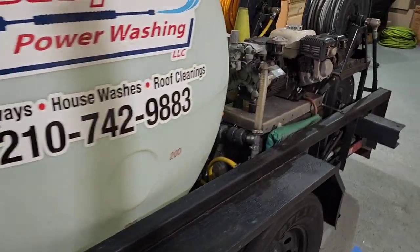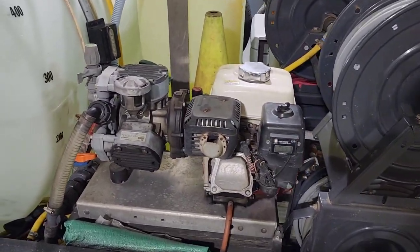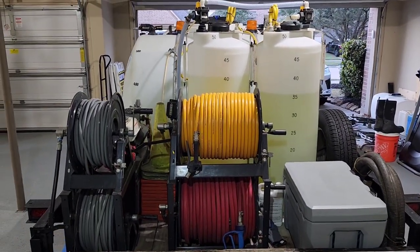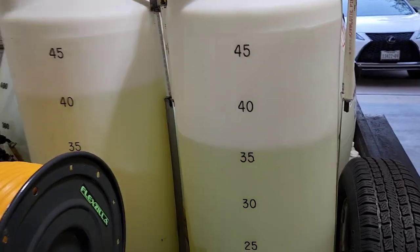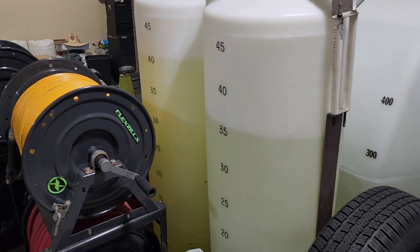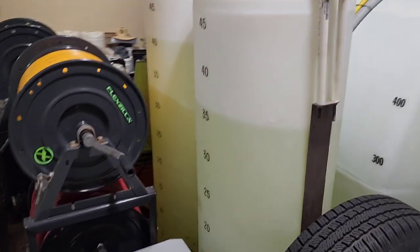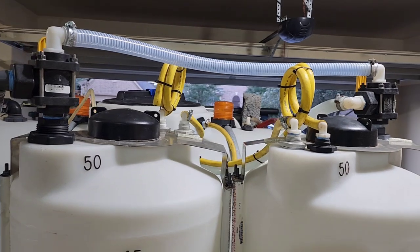Going to the back, I have a Comet P40 gas soft-wash system — works really well. I also have two 50-gallon vertical round tanks. These are different from the 55-gallon square vertical tanks I used before; those kept cracking in the corners from the stress. These round tanks have no stress cracking in the corners. Both 50-gallon tanks are connected together and I can use one or the other.